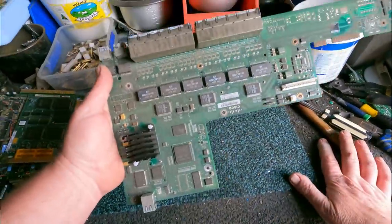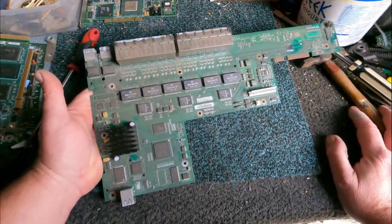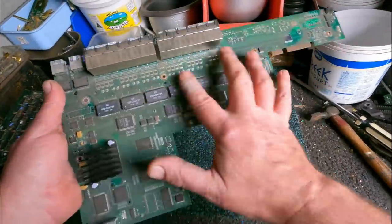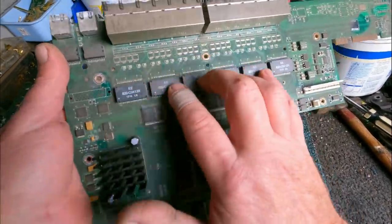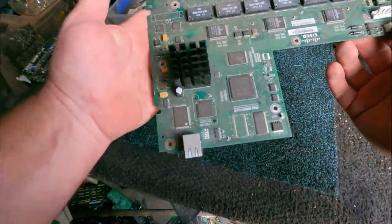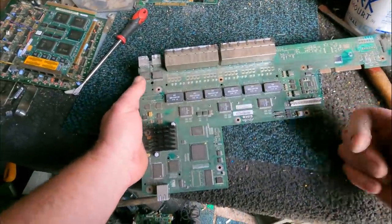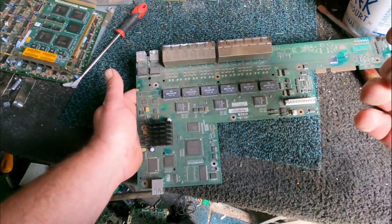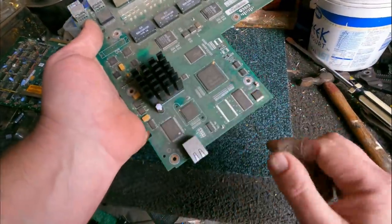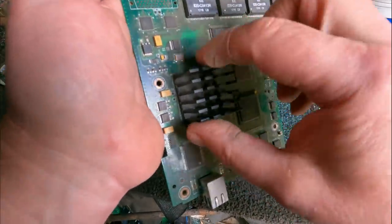Here's another good example of one of these Cisco router or switch type boards. They look impressive, but again, too much dead weight. All this is dead weight - it looks like IC chips but they're not, they're copper coils. So what have we got? We've only got this bottom section here. As it is, it would get close to being a server grade - whatever grade is below telecom grade. We've got a BGA here, BGA there, all good. We don't want to touch all this - we want to keep this as a server grade board. But again, we've got two gold band crystals and three tantalums - that's all I'll take on this side.